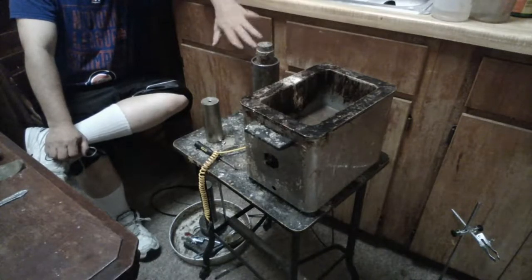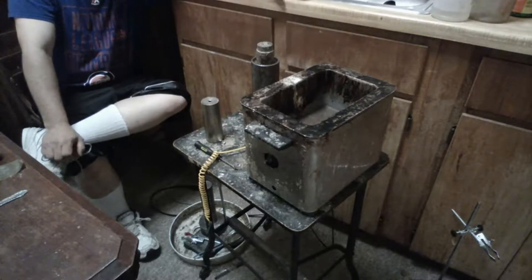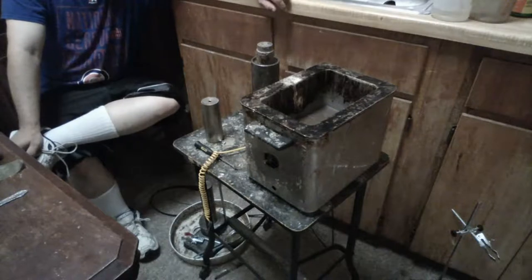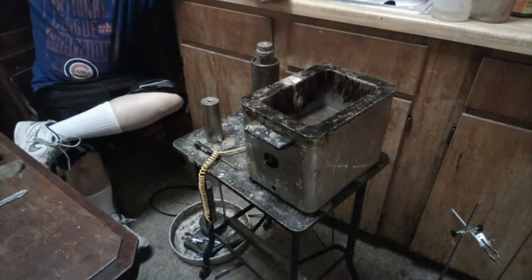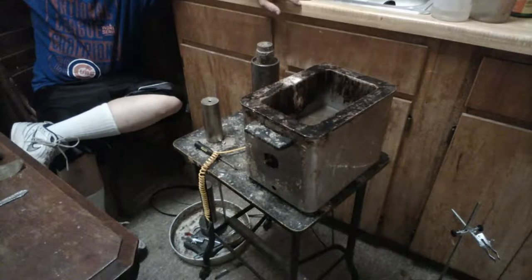And a finished normal blank is 2.150 to 2.180, which is the normal range that the Edison phonograph will take. You can actually squeeze one in at about 2.195, but you're pushing it on some people's machines. Their reproducer might... every machine, the linkage is a little different, like on a Model C reproducer or an automatic. You don't know if somebody has a reproduction linkage, or somebody made a different linkage, or if it's an original linkage.